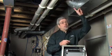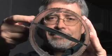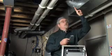What's a duct damper? Here's a typical one. The more you close the damper, the more it chokes off air flow. Note that the slot in the bolt shows the position of the damper.